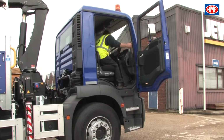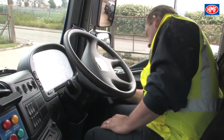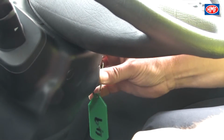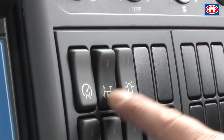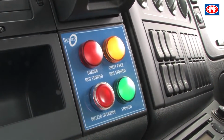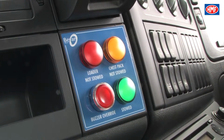Upon entering the vehicle, check the gearbox is in neutral, start the engine, and depress the clutch. Wait 4 seconds, then engage the PTO. It can be located to the right-hand side of the blue crane control panel in the center of the vehicle